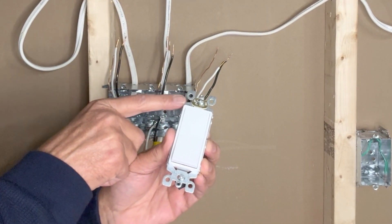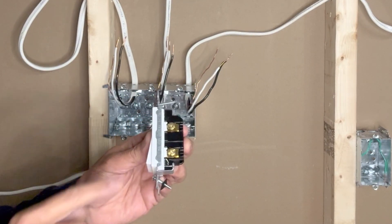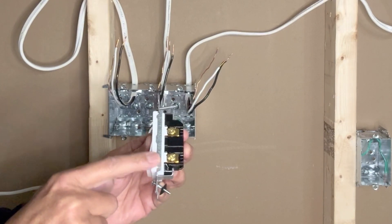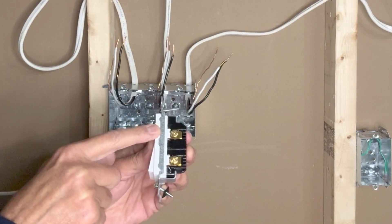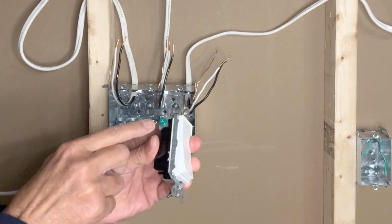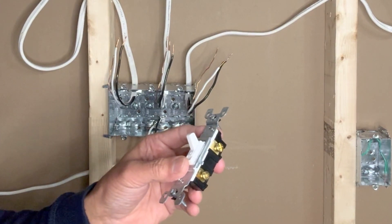For the purpose of this demonstration I will be using a Leviton Decora-type switch. The switch has a self-grounding brass strip at the top. On one side we have two brass screws — normally the incoming black hot wire is connected to the bottom terminal and the upper terminal is connected to the outgoing black load wire. We have a green grounding terminal on the other side.